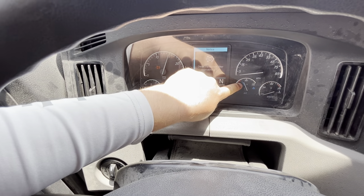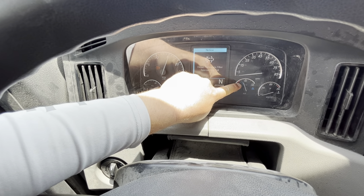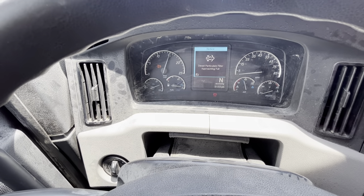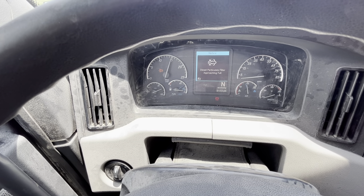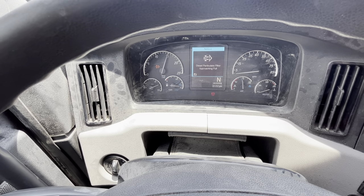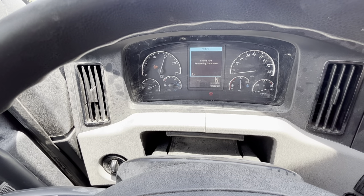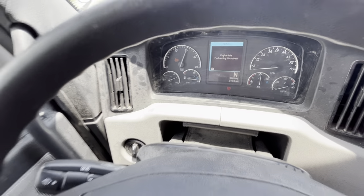My primary and secondary are approaching 80 PSI, so I'm going to ask the examiner to start their timer. Within 45 seconds I need to be at 100 PSI. I'm at 100 PSI, so that was a good test.